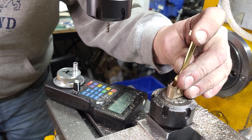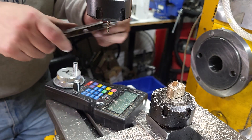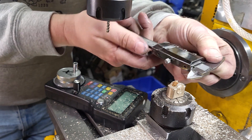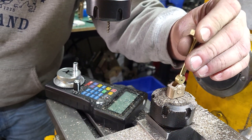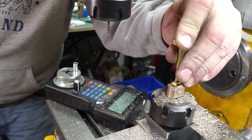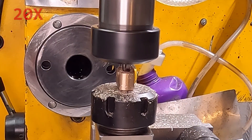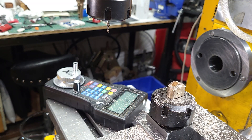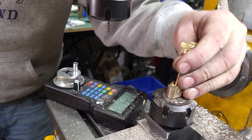This came in a little bit undersized, so I did another couple of spring passes to bring it out to the right dimension. After about two spring passes it did come out — these little 1/8" end mills apparently flex quite a lot when they're at full depth and you're side milling. But now the connecting rod goes in — maybe one more spring pass — yes, that works, good.